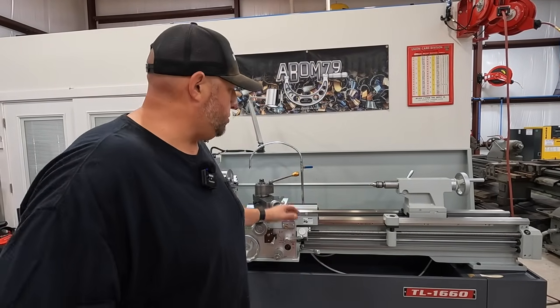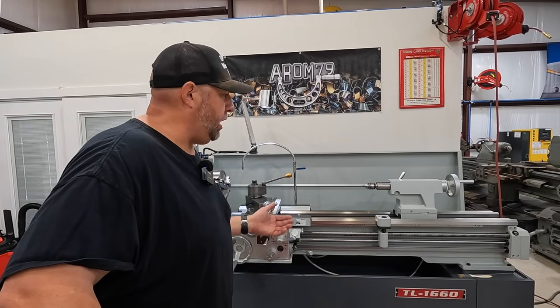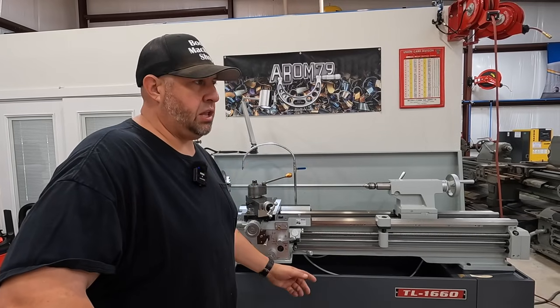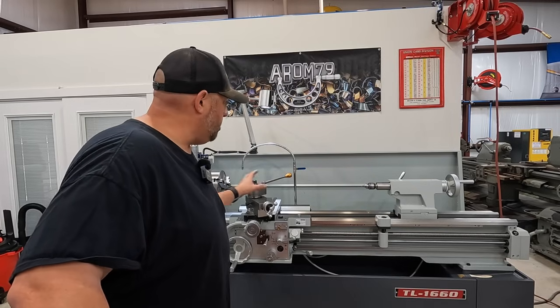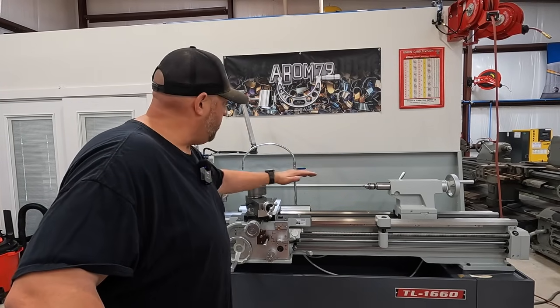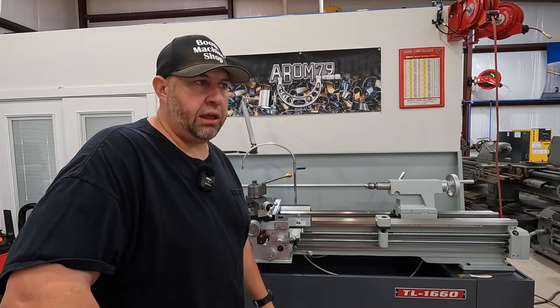So I do have an added benefit of the Precision Matthews lathe. Well, there's a couple of benefits here. One, that it's a brand new machine. We've already inspected it. We know that the tailstock is aligned properly. The headstock is near perfect alignment on it. So we should be able to make a nice straight cut, and I should have no worry of the alignment of the tailstock making the part pull down or anything like that, like I have to deal with the Monarch.